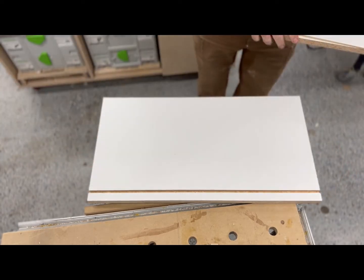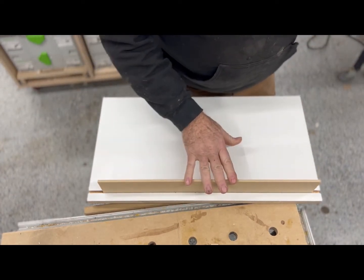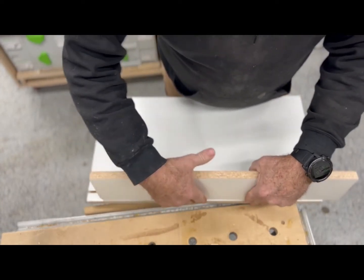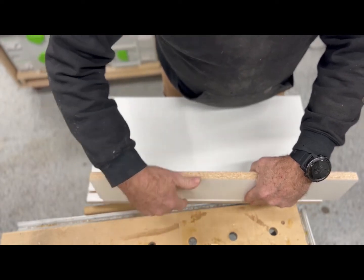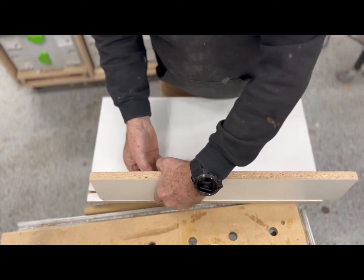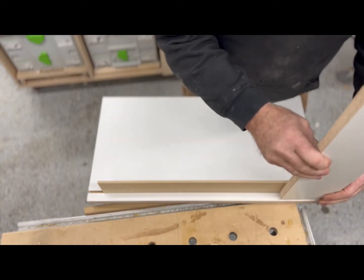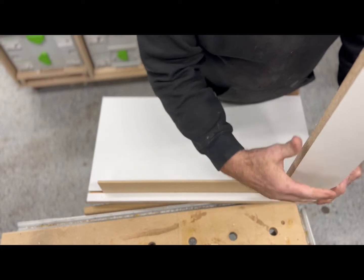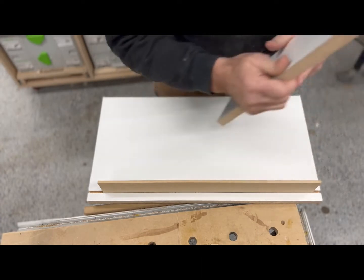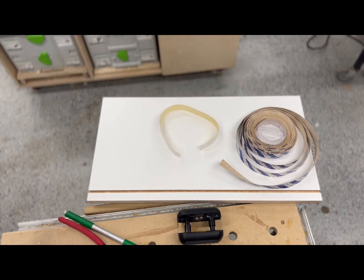All right. So when I set up that panel, I set it up so that whatever back panel I'm using in there comes just ever so slightly inset, probably 1/16, not even a 1/16 of an inch. And then the other thing I'll do, and we'll go through it when we do the assembly, is I'll do pocket holes in the top and bottom, and then also on the top so that it can be screwed together. But we'll go through that when we start doing assembly.